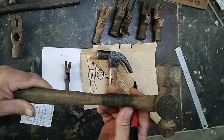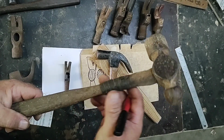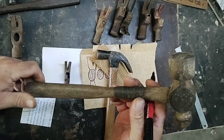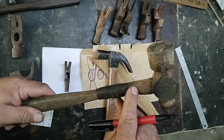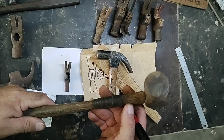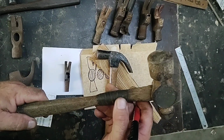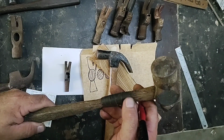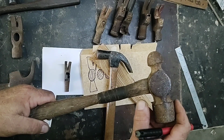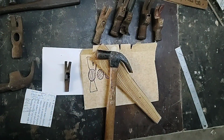Now, this little ball peen hammer handle is a very narrow one. I don't know why they made it narrow, but look, it's obviously lasted, though it started to splinter away up the top. Now, the grain orientation, when I looked at it, wasn't too bad, but I don't know if the timber choice was great. Whichever the case, this area has been flogged around a bit and mauled a bit, and that made that point weaker. And that's one of the main causes.